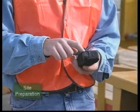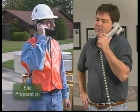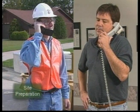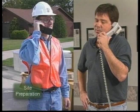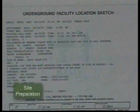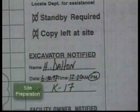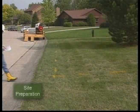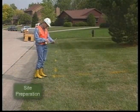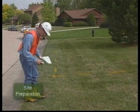Site preparation involves the participation and coordination of several persons and agencies. First, confirm with the boring contractor that one call has been contacted. Confirm that utilities that do not subscribe to one call have been contacted, and confirm that the site has been accurately marked. It is recommended that all information pertaining to the locate request be retained for future reference, including the one call confirmation code or ticket number, and locate sketch if supplied by the facility owner. It is a good practice to take a copy of the sketch to the job site to confirm the locates. Some localities require the sketch and ticket number on the job site.